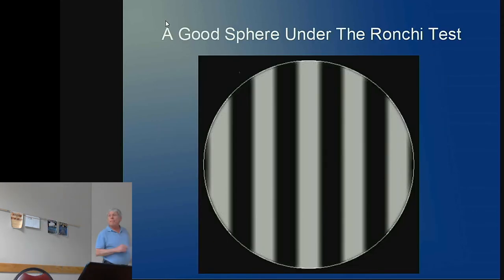Now, how far away is that from your lens? It's got to be much further, doesn't it? If the mirror has a focal length of 48 inches, for instance, the tester will be two times that away. Don't you have a parallax problem then? No, as long as things are reasonably lined up, you don't.